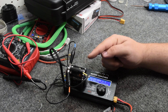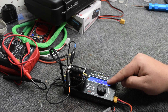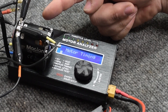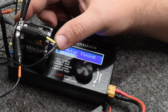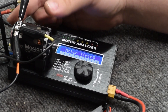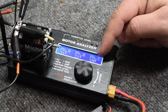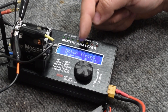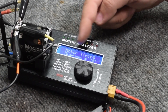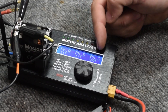Currently I set the end bell to 30 degrees for timing. Let's go ahead and check timing on our motor. I went down to option number two for motor timing, press to start. It's going to do its thing. It's rubbing the plastic — that's why it sounds so loud. So according to this, I have an average timing of 30 degrees: 31, 31, and 29. That is why you have sensors A, B, and C — it's 31, 31, and 29, so an average of 30 degrees.